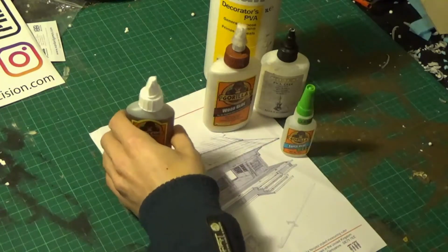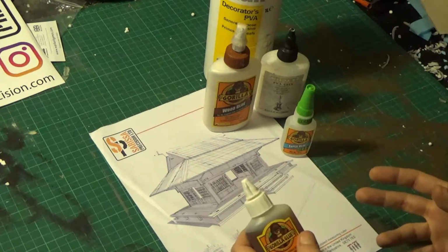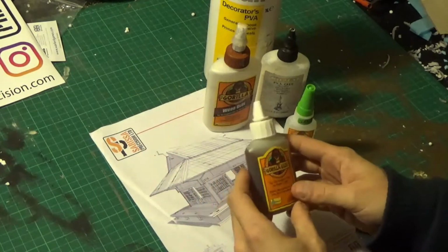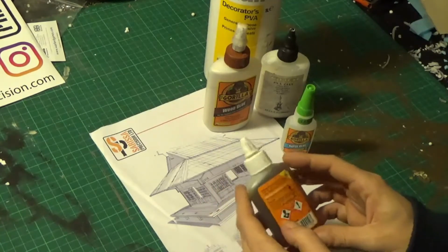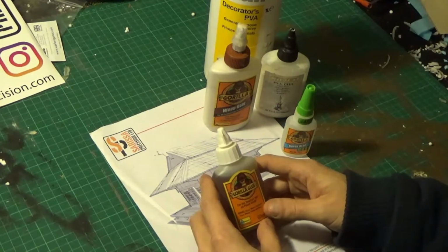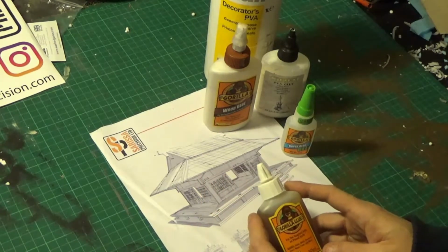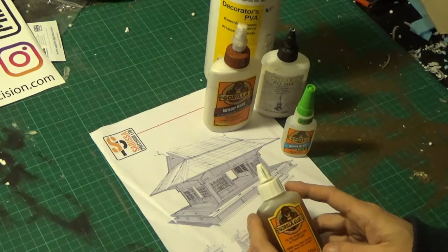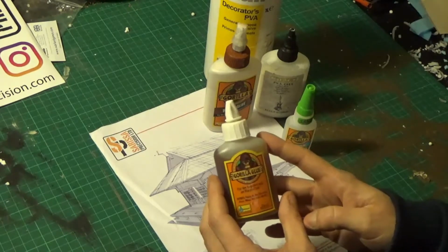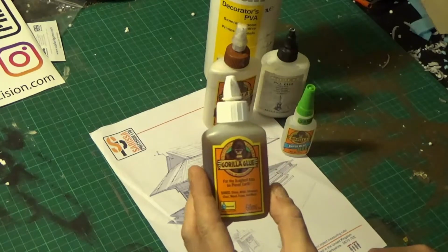So next up, feels like I've sponsored Gorilla Glue here, but these in my opinion are the best ones to go with. So next up we'll look at the other Gorilla Glue. Now this is a polyurethane based glue. Once again, you will need clamps like the other Gorilla Glue stuff. The thing to watch out for with this is it expands when it dries. So you're going to need clamps, and you're probably going to need some very heavy weights as well to stop things from moving. It will cause things to shift. But if you use this, I guarantee you it will not break, providing that you use this properly.